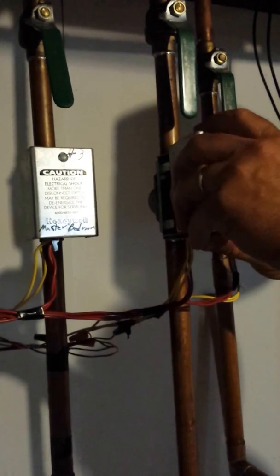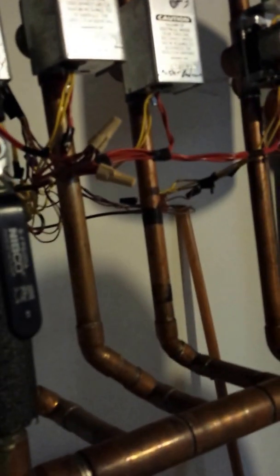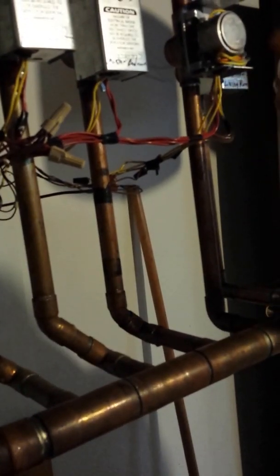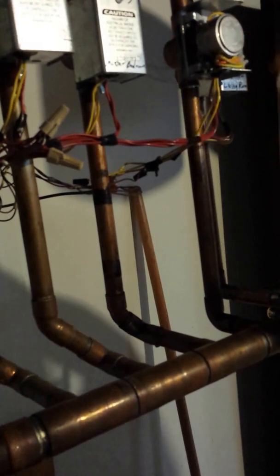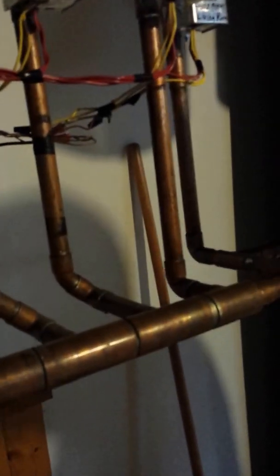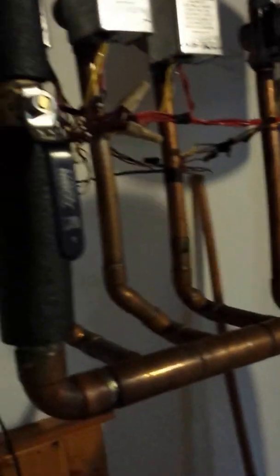But if it's not firing right now, holding this open manually will not turn the motor on because it doesn't close the switch. The thermostat has to power the motor, and it goes a little bit farther than I can pull it manually. So pulling it won't start the hot water, but it opens the valve so it will always flow through it should another zone call.